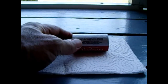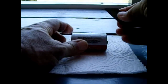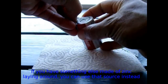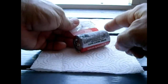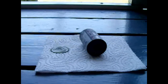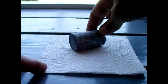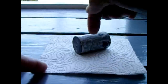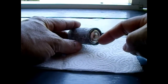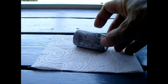We're going to remove this part. You don't really need gloves for the battery disassembly — it's just some zinc and carbon — but you can put them on. You want to remove the outer shell. The zinc is right here on the outside. We're going to remove the zinc housing. We need this whole layer of zinc on the outside. We're going to pry this open on the end, remove the end piece with the positive terminal, throw it away, gut the whole thing out, make sure it's perfectly clean, and drop it into the acid to dissolve.